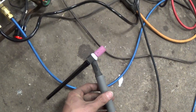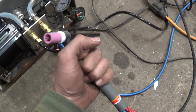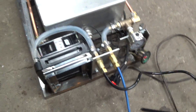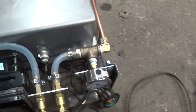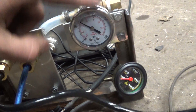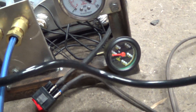You can see that hose jumping around pretty good, but in the torch it's not nearly that bad — I can just feel it and it's not ideal. If anybody has ideas on how to fix the pulsating, I'd love to hear them. I'll go ahead and shut her down. She's set a little high right now, about 60 PSI or so. This here is the PSI gauge, this here is the temperature gauge — obviously not warm at all.